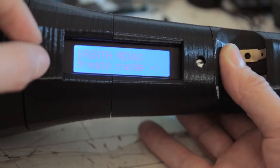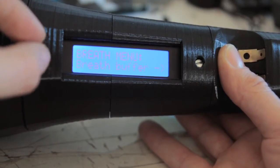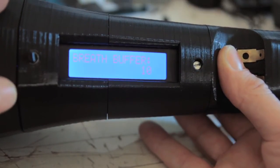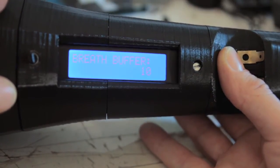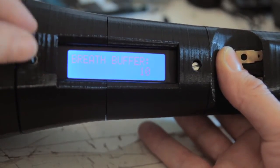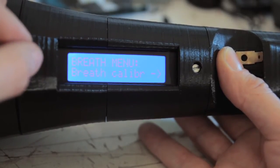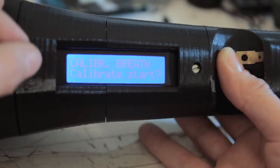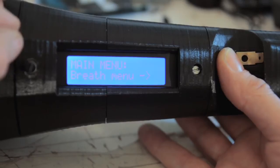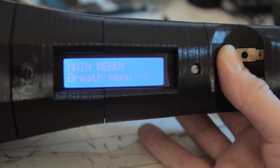In the breath menu, for example, we have a range value of 0 to 127, and a buffer value which is the dead space at the beginning of the breath sensor values — so 0 to 10 gives no results and then it starts counting from 10. I can adjust this up to 50 right now as the maximum. Then there is the calibration, which is totally automatic: you start calibration, blow into the mouthpiece, then end calibration, and the new minimum and maximum values for the breath sensor will be set to what you just put in.